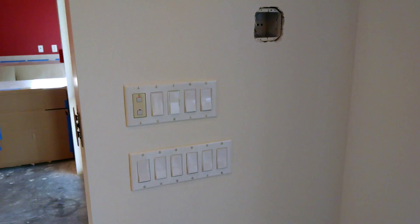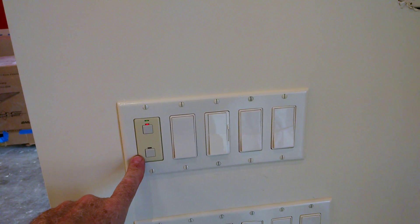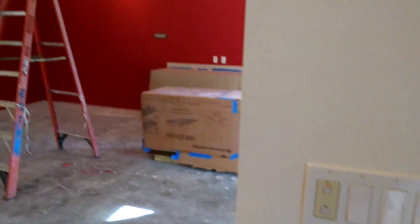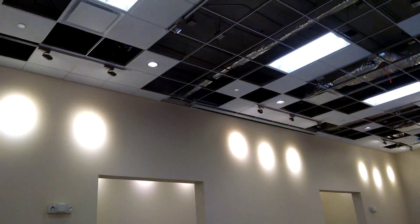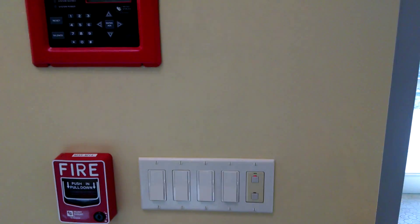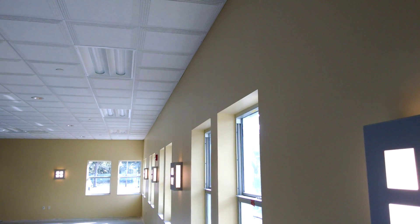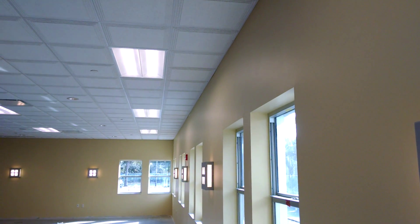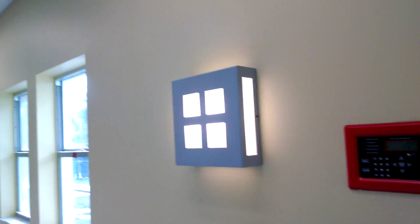This is the setup for this room. The Chelsea switch is this one here. I push this button and all the lights in the room except the 2x4 lights are going to go off. As you can see, we're not finished the job yet — still got the ceiling open. This is a 15-foot high ceiling in here. This is the switch setup for this large room. If I touch this bottom switch here, all my can lights are going to go off. All my can lights are going to be on — the 2x4 lights are off. And all my room lights remain on. But when this thing is timed out at five o'clock in the evening, all these lights are automatically going to go off with a relay. That's a pretty neat system.